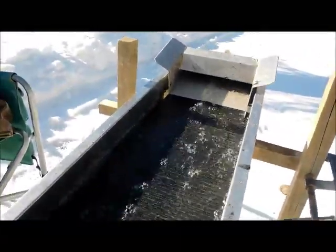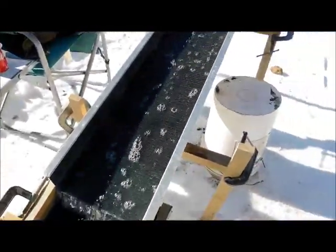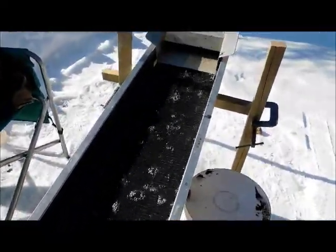And what I've noticed is once it hits that mat, it ain't moving. So I can sit there and let it run and it doesn't really go anywhere. The Mega High-Low VMAT, I don't see much gold down here at all. I'm sure there's some down in there. But we'll let that run for a second. We'll get it cleaned out and I'll run it again, see what we get up in the mat, up in the top, second time through. But dang, that looks good.